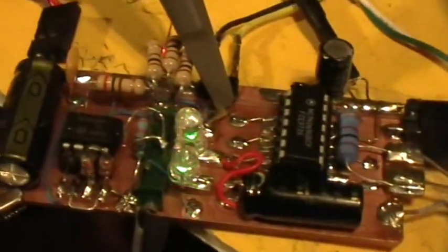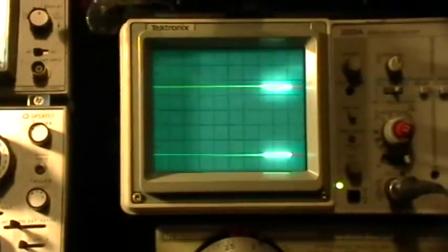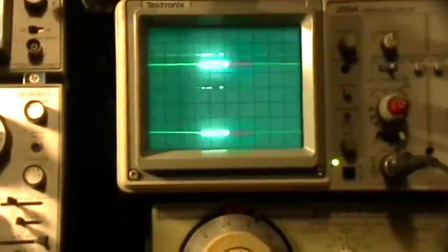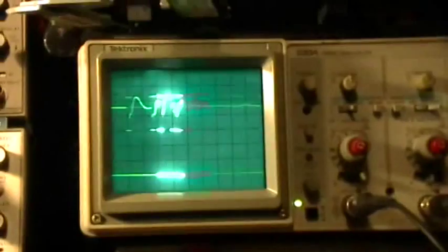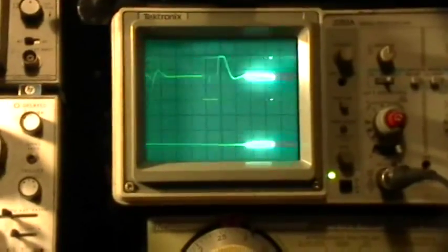This is really hard. It's like little twitches of the pot will make the LEDs come on, until you start getting down into the range where they start staying on for a little bit longer. At that time, you start seeing those spikes on the top trace. I'm continuing to turn the pot, and each time I turn it, you see that burst of noise on the top trace. Now we're finally starting to actually get some signal — the LEDs are staying on.